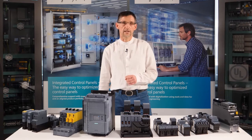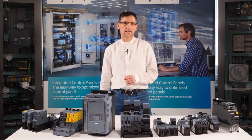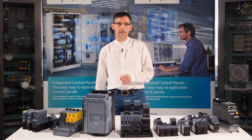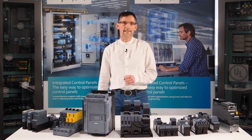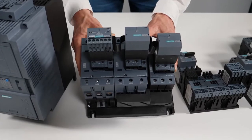For this purpose, the three-phase motor is first started in Star configuration, and after acceleration to rated speed, continues to run with Delta configuration and full voltage. Only then can the rated power of the motor be reached — it is three times as large as with Star configuration. Star Delta starters are usually built up from commercially available contactors. Here you can see such a combination with mains, Star and Delta contactors.